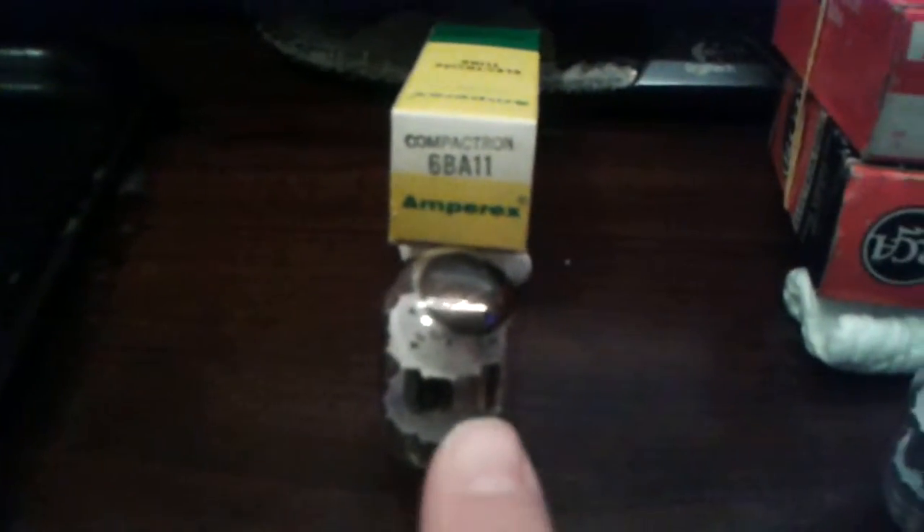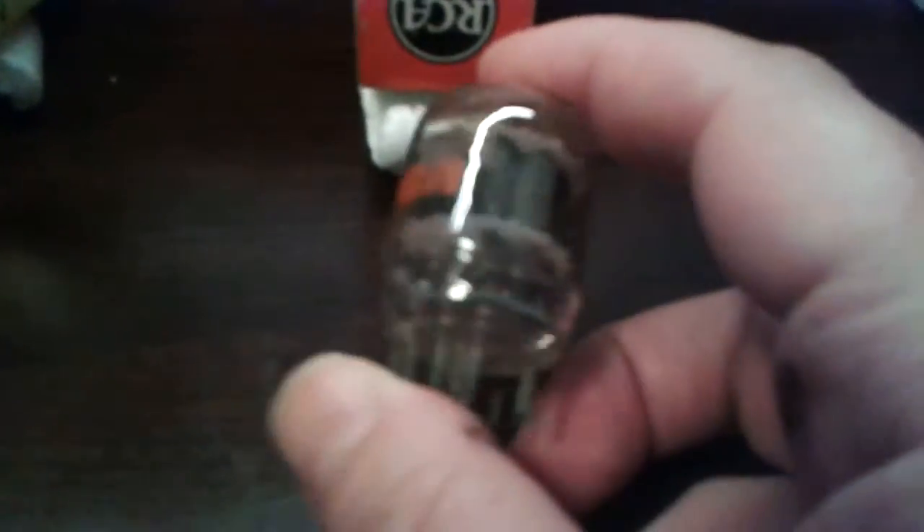What I've set out here, just to give you an example: here's a 6BA11 — that's twin pentode and triode. I haven't really figured out what to do with that. This cute little one is a 6U10, and it's a triple triode. You can make great preamps with it — I've heard you can make a great RIAA preamp for your phonograph, all tube, with just two of those. Then there's these two: the 14BR11 and the 6AF11, which I've built an amp out of. They both have two triodes and a pentode unit.